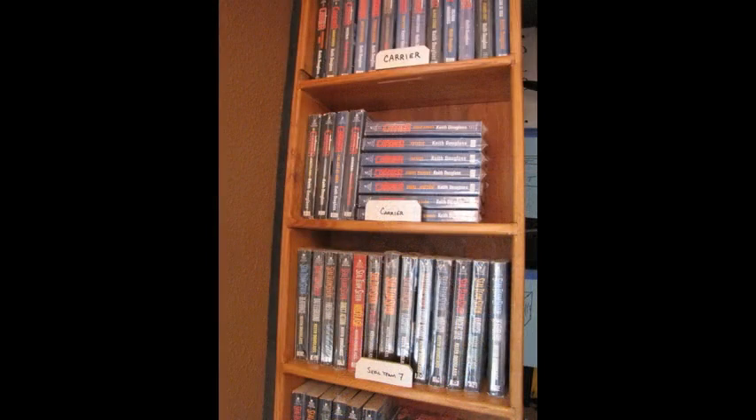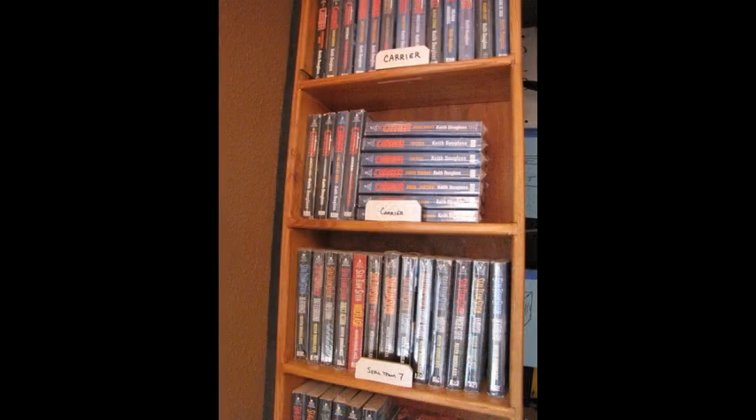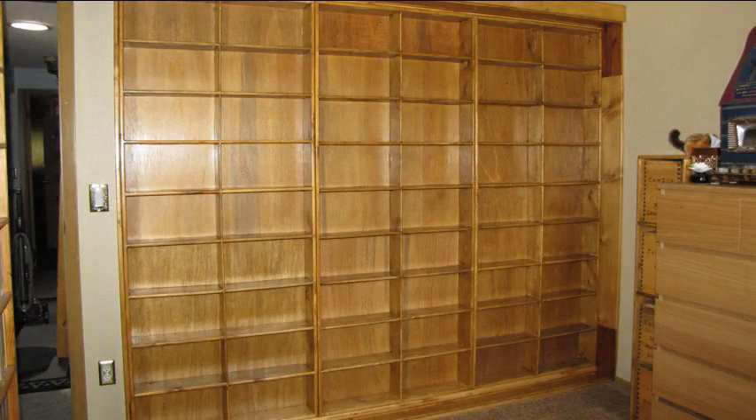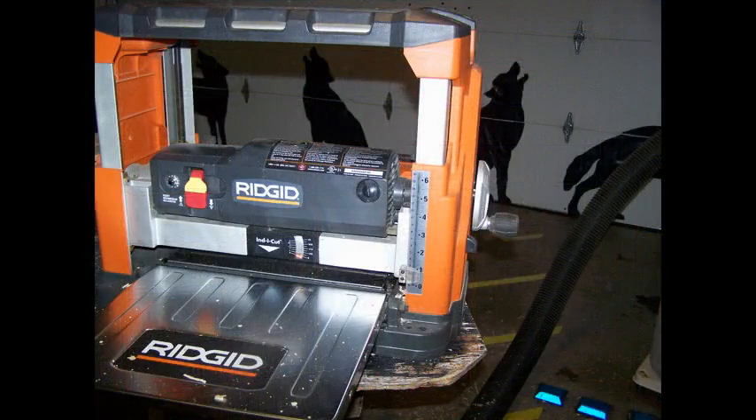For example, I built this nice square bookshelf and placed it up against the wall. The bottom was flush, and I had to put in over an inch of filler at the top. It's also imperative during bookshelf construction that your boards not be cupped — if they are, your books won't sit flat. To fix this, before using them, run the boards through your planer.